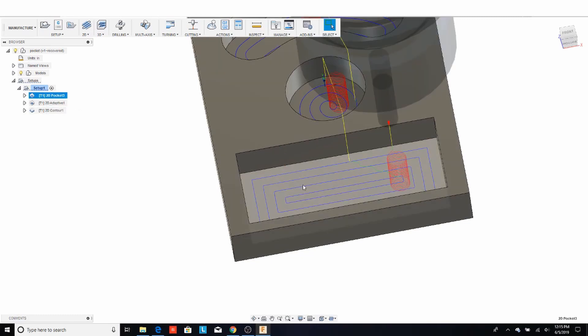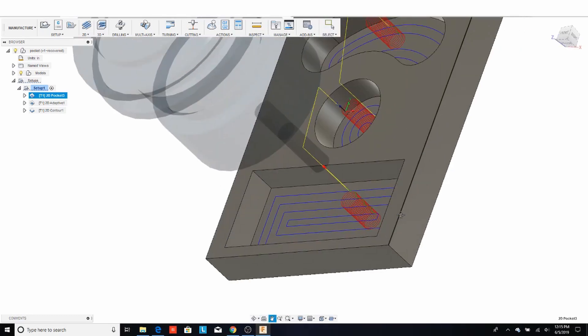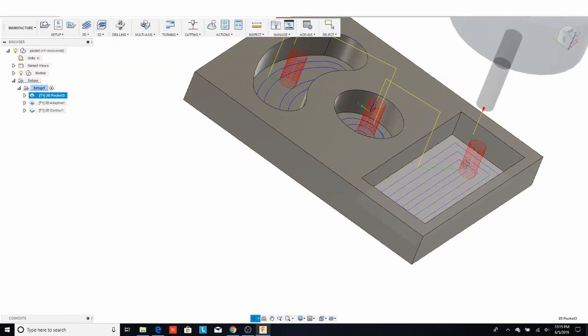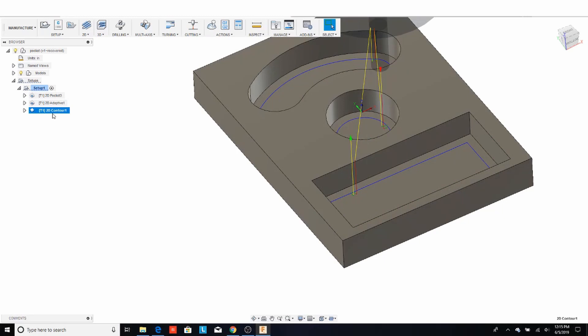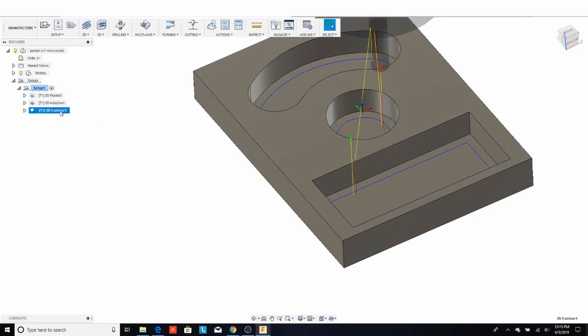The downside of using a finishing contour pass is you need a tool change. For a few one-off pieces, the tool won't wear down so you can just do it quickly. But if you're running 100 of these, a tool change might be needed if your machine is fast enough to save on cycle time. On older, slower machines in a production environment, you're going to regret every tool change.